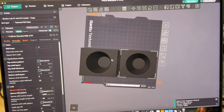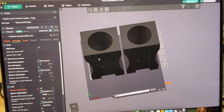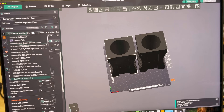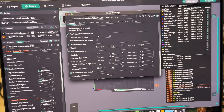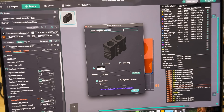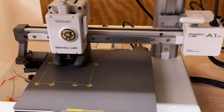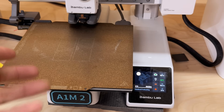I don't have enough filament inside A1 mini 3 with the yellow to slice three of them. I'm going to use our Supertac profile — just using the smooth high temp plate for the Bambu Supertac. I've found the best luck with that when using Orca Slicer. Sending this over to printer 3. The yellow just started printing on A1 mini 3, and A1 mini 2 had some sort of SD card reader issue so I had to shut it off and resend the print.